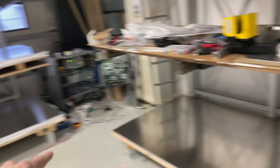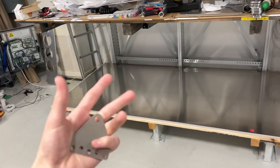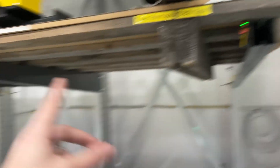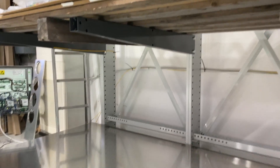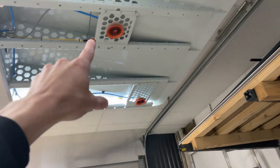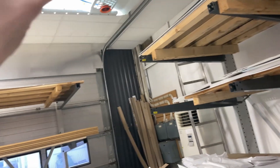One thing that got cut out of the last video: I'm using these lasers here to orient — well, to compensate for the orientation of the sheet. So if it's crooked while you pick it up, you're gonna know that so when you place it on the table it's gonna be in the right spot. These lasers shouldn't be on these arms because depending on how much weight I put on them, it's gonna slightly tilt more forward. So those are gonna be on arms down here instead, but that's for later. I'm also gonna replace that laser with an ultrasound sensor because of the reflectivity of the sheets making it difficult to get an exact measurement to the distance of the top of the sheets. Details, details.